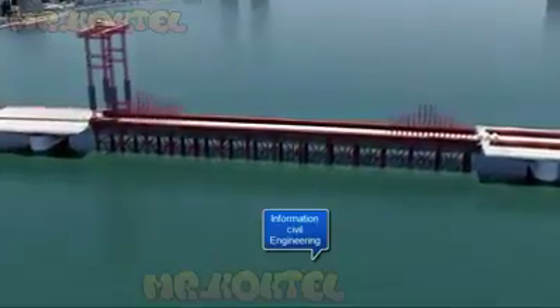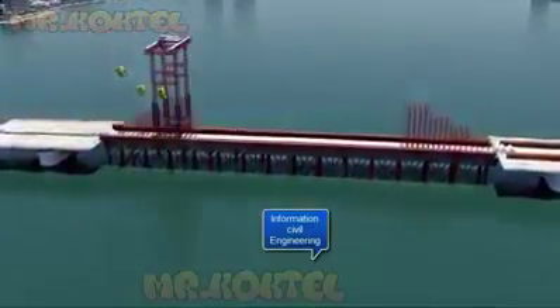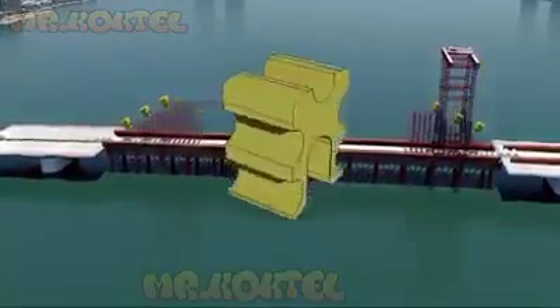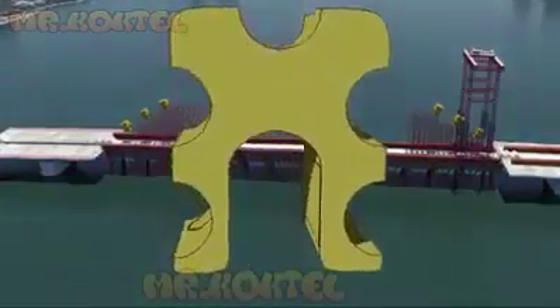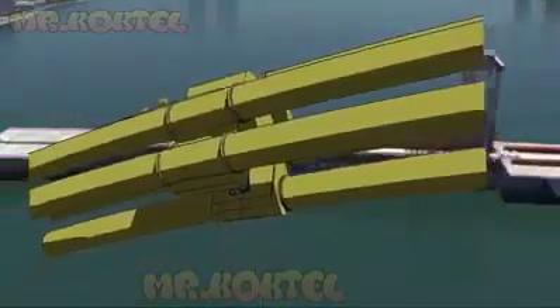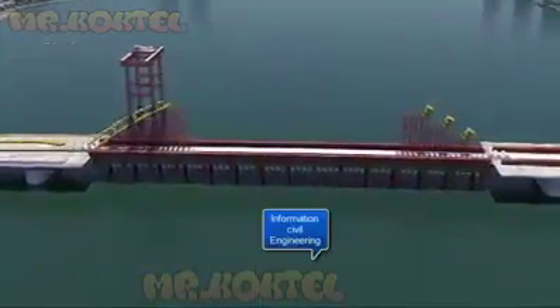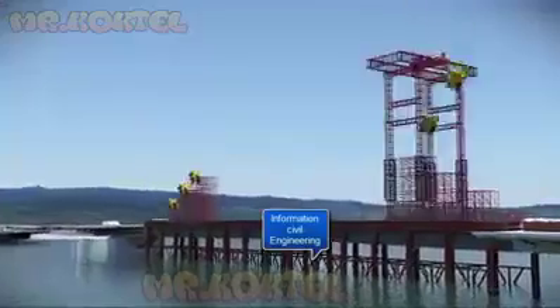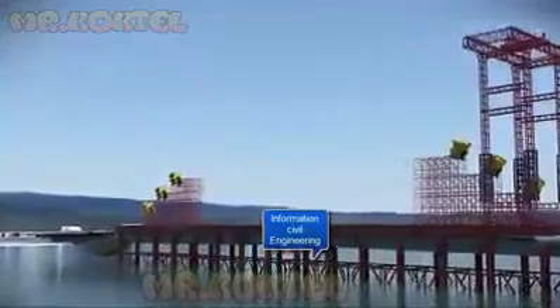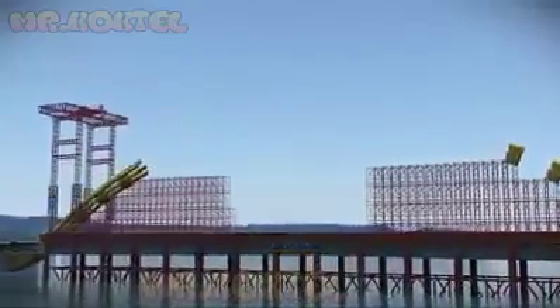A special crane is constructed that will lift the arches into place, and temporary scaffolding is used to support the special frames called spider frames. These frames tie the five pipes together, spreading the suspender load uniformly to all five pipes and serving as a point of anchorage for the group of suspender strands. The crane assists in placing spider frames atop the temporary scaffolding, then adding the pipes from both ends, finally meeting in the center.